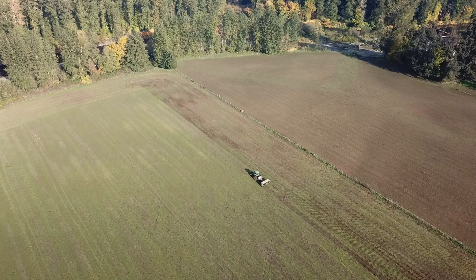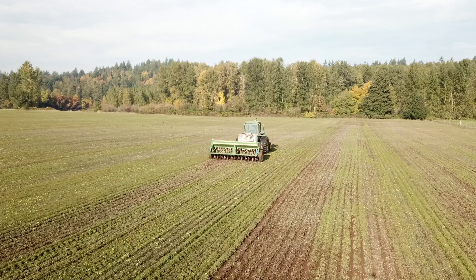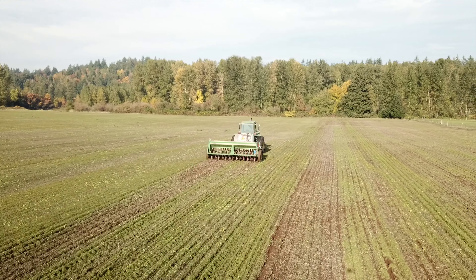Our openers are running pretty smooth and mud-free. This soil type is a very tricky one — it sticks like none other, and we were worried that mud building up on those side wheels was going to ride the opener out of the ground. But as you can see, the side wheels on those openers are coming up pretty clean. The cover crop residue rolling in there is keeping it up out of the mud, providing a barrier between the soil and our side wheel. We felt like we had good planting depth, and as you can see back there, it's just rolling that cover crop right by the row.